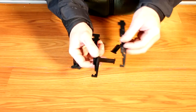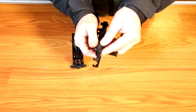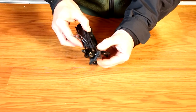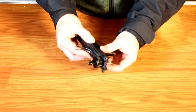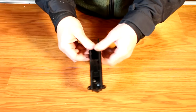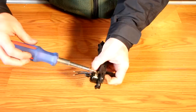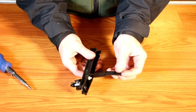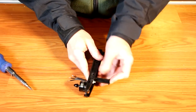The landing gear goes into the vertical slot with the strange-looking rectangular piece, locking it in place. The two side arms go together, and then the motor mount goes on the top — the hooks and the long tabs are towards the top. Slide the hooks in place, slide it back, push the tabs through, and you have yourself another arm. Once you have the arm all tightened up, go ahead and insert the last support of your landing gear into both pieces. I recommend gluing this, but friction seems to hold fairly well.